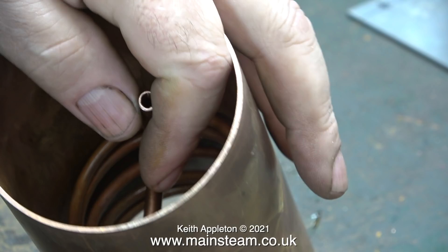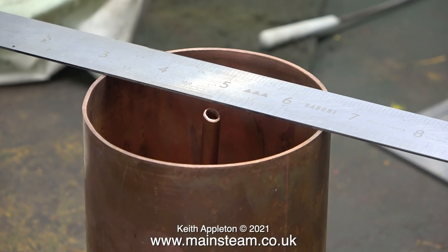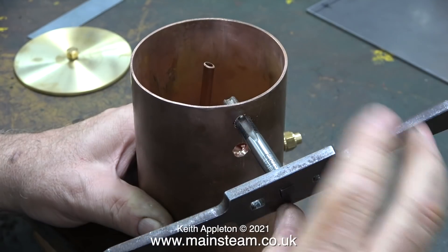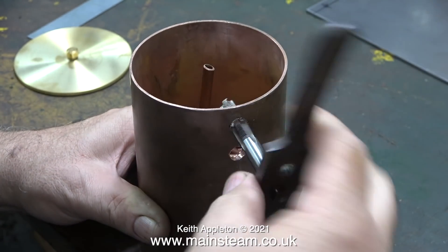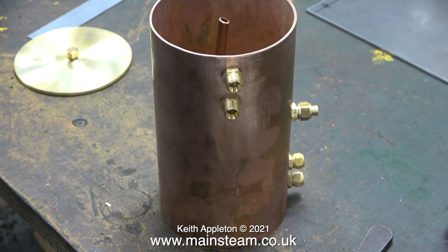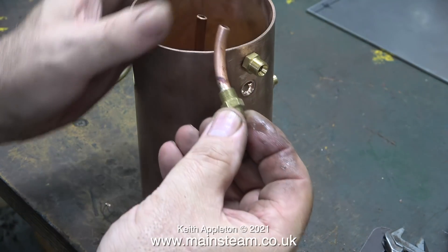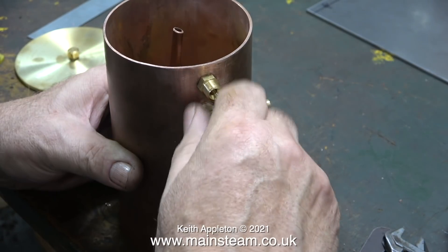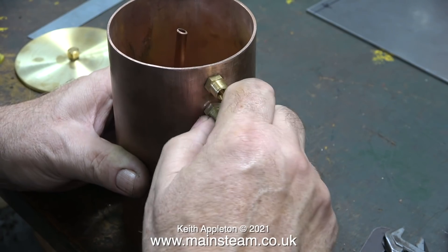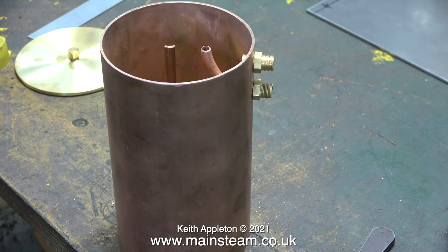Contrary to what I get told by many expert viewers, this spanner does not seem to round any of the nuts that I use it on. I bent a piece of copper pipe to 90 degrees, silver soldered on a union cone, and in this clip I've just tightened it onto the inside of the fitting. I'm checking that there's sufficient clearance between the end of the pipe — which is purposely chamfered — and the top of the condenser. The next part of the job involves drilling two holes in the side of the condenser near the top; this is where the exhaust from the steam engines will enter. Once I drilled and threaded the holes, I fitted a pair of 3/8 by 32 threads per inch double fittings — standard commercial ones. The only difference is I drilled the bottom one a quarter of an inch to take a piece of bent quarter inch pipe, which will allow the exhaust from the second steam engine to exit very close to the top of the condenser.